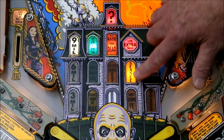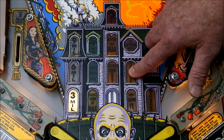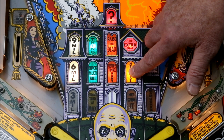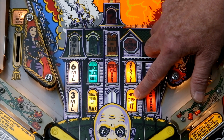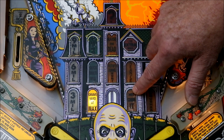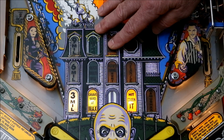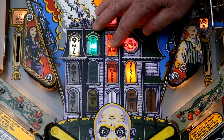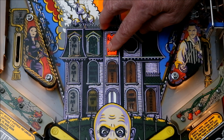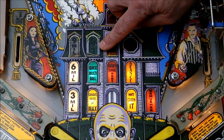Here's another example. This is the clear dome. This is the frosted dome. The more I look at these, the more I like the clear domed LEDs better. Besides being slightly brighter, they focus more light in the middle of the lens, which brings out the starburst design molded into the lenses. So, what I've learned from all of this is that I prefer the clear domed, single SMD type lamps with matching colors under the colored lenses.